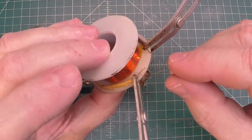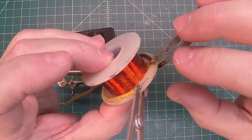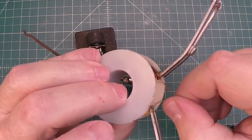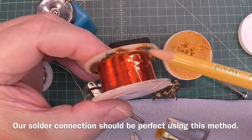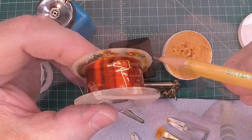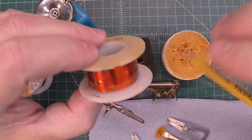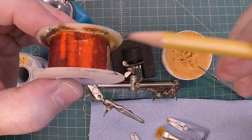This will be really hard to see, and I'll continue to do this off camera, but what I'm doing is just taking the magnet wire and wrapping it around the conductor here to form a coil. A closer look now with everything soldered up, and I checked DC resistance, and we're good. When the canister dries, we'll go ahead and get this placed in it. Of course, I've still got to wrap the humbucking coil back around.